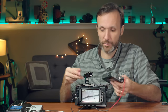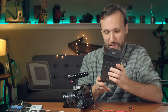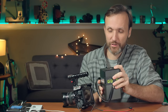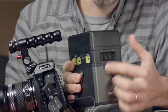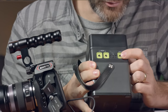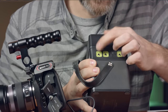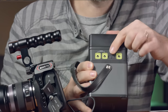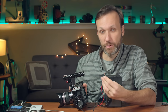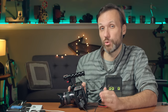The smaller battery makes mounting even easier on the top or side of the cage. If you want to power the camera even longer, there's this larger battery that even has an AC connection, various USB connections, and DC connections — including 19 volts at 4 amps and 12 volts at 5 amps. Keep in mind you want to provide at least 12 volts and 2.5 amps minimum to the camera.